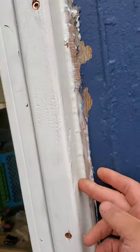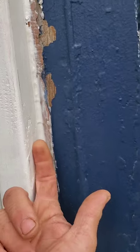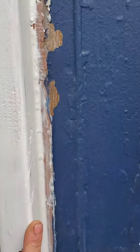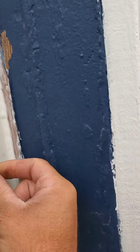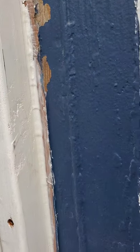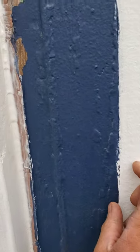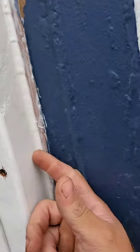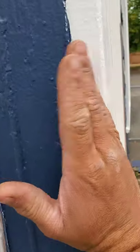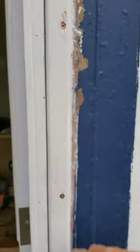So over here we have these pieces, right? Well, we want our plywood to be flush with this, but our plywood's 3/4 inch thick. So what we're gonna have to do is rip us down some studs that are only, well, this minus 3/4, one here, plywood will sit there.